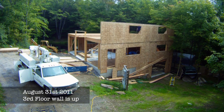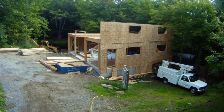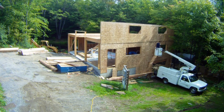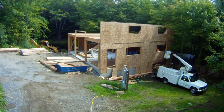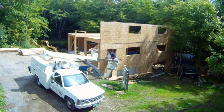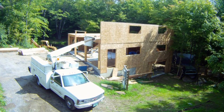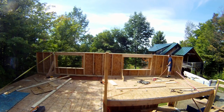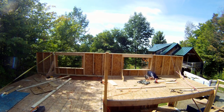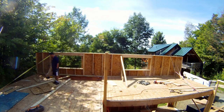The other thing about building a wall this long — maybe it's because I did it over a span of two weeks since I put a nail through my finger — but this wall was absolutely the worst one I built. If you look down the edge of the wall, it looks just like a wave. Over 36 feet there's a lot of variation in how I built it. The top plate does a wave thing and over 36 feet is off by about an inch in a couple spots.